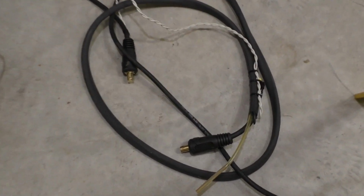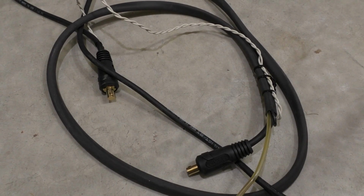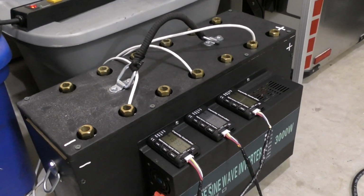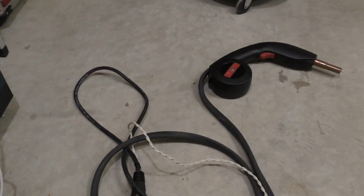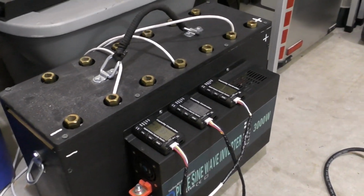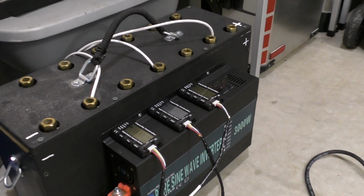And over here, I converted the ends of the Ready Welder to Dinse quick connects instead of the Anderson power connector and jumper cable style clamps that were on there originally. So this allows me to roughly choose the MIG welding voltage by just choosing which connector I'm using up here. I'll be using flux-core .035 steel wire, and I'll be running electrode negative, and undecided on the voltage. I'll probably be somewhere around 20 or 24 volts to start out with, just for some testing.